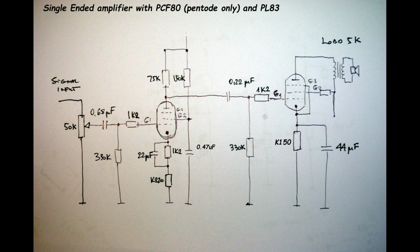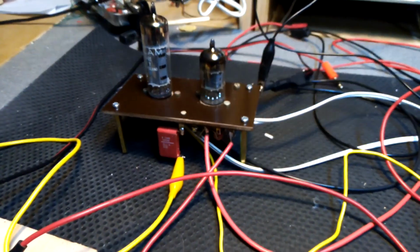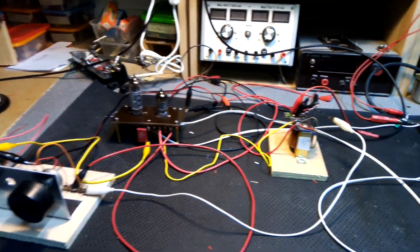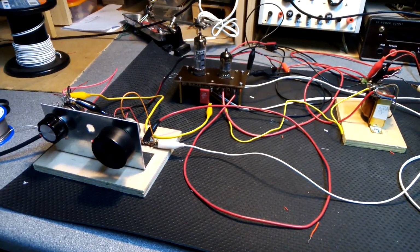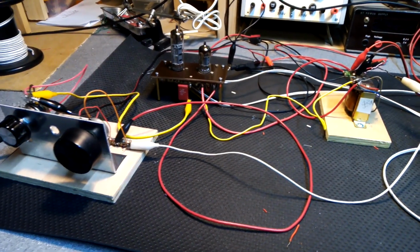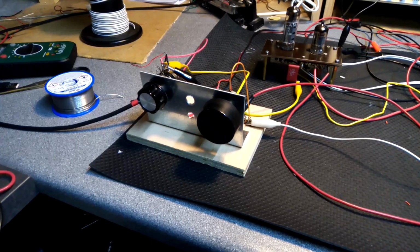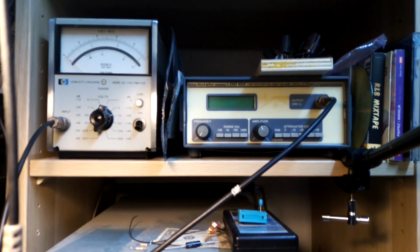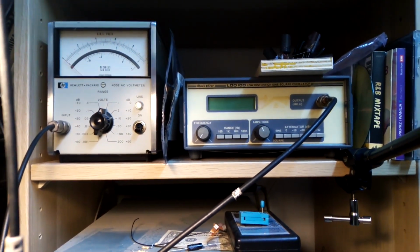Okay, so this is simply a single-ended amplifier built on junk parts, including junk transformers, junk speakers for it, etc. So we don't want to fight for every hertz below or over a certain range. Of course, it will always be better than worst, and I don't want to keep the old reel-to-reel recorder range up to 12 or 10 kilohertz. I want to go at minimum to 17 kilohertz.